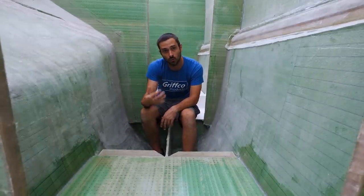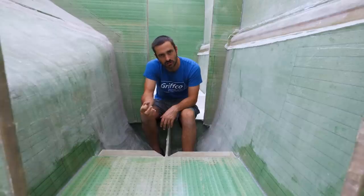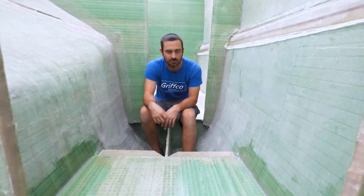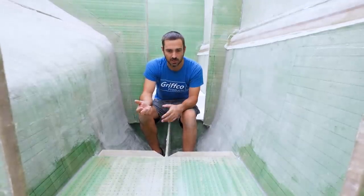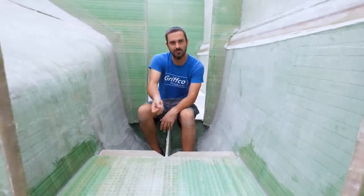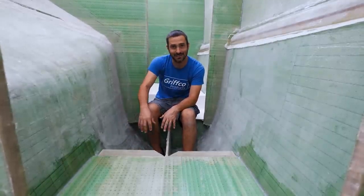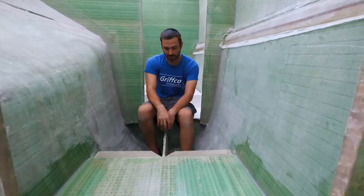It would be a lot of extra weight, because closed cell foam actually does weigh a lot. It does get waterlogged quite commonly. If you look at old Boston Whalers, they had closed cell foam in them and those are triple the weight of what they are now because water just sucked in there. So we want to prevent that from happening by not having it there. And it's a cost situation too - it's expensive. And again, there's no purpose.